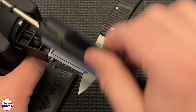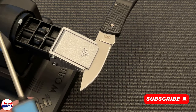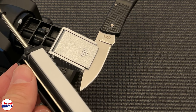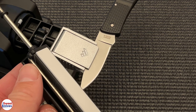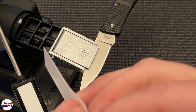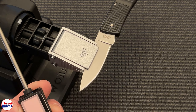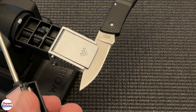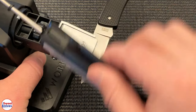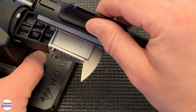I go a little fast on video, so you guys at home just take your time a little bit more — you don't need to go quite that fast. That's it, we're done with the blue. Those are so nice — they just come off, they stick and peel, and then you can reuse them. Now we're moving on to the pink, which is 3 micron. This starts really putting a nice mirror on the blade — you'll notice now it should really start putting a nice mirror. These next three are kind of the finishing ones; they really start putting that polish on.